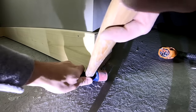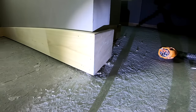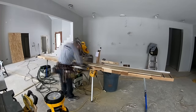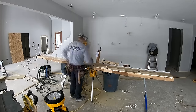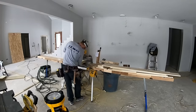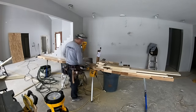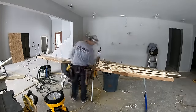I like to cut all my baseboard outside corners at 46 degrees — that seems to work well for keeping the outside corner closed. Occasionally they still open up; in that case I'll use a steel object to burnish the edge, sand it a little bit, and you're good to go. The most common question I get regarding this type of baseboard profile is whether the front edge, which has a round-over on it — usually a 5/32nds — needs to be coped. For me the answer is no.